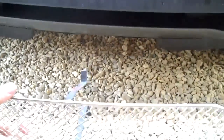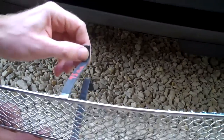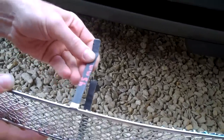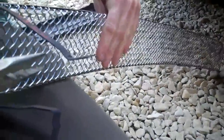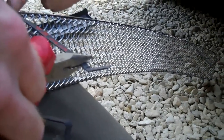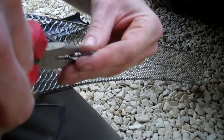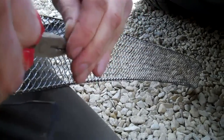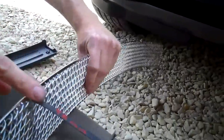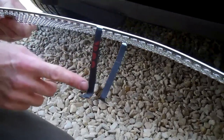When you get your mesh grille, it has these rubber-coated tabs made from stainless steel that you can bend — they come flat. You need to bend up the tabs. The rough dimension for the top tab from the grille to the bend point is 95mm. Put your pliers on there and bend that up to form the hook. On the top of the grille it's 95mm, and on the bottom tabs the bend point is at 90mm.